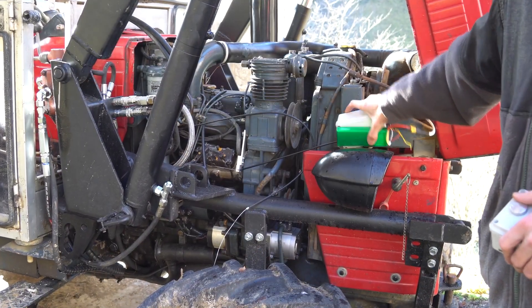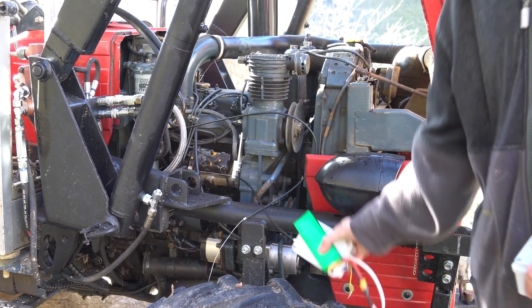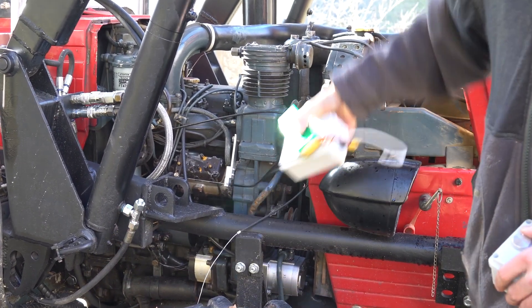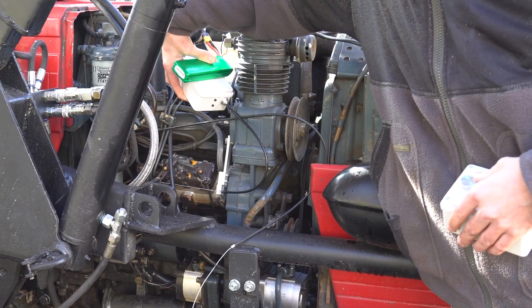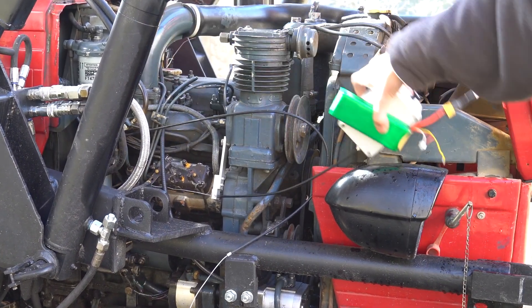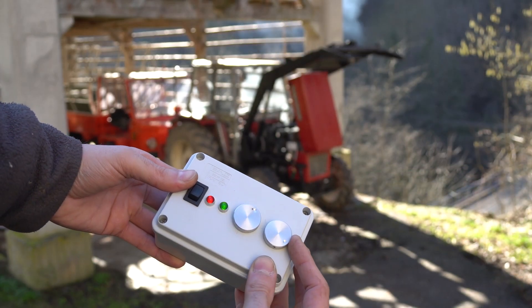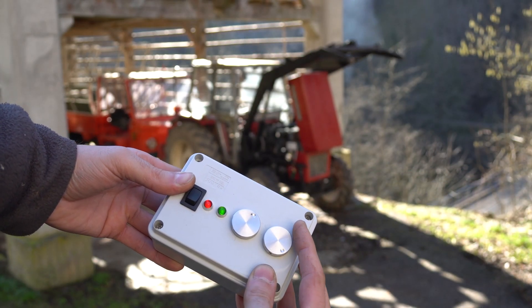Because of the steel wire inside a bowden cable, we can mount it wherever, in any position — even in a cab with a few meters of steel wire and bowden. For all the components I paid about 60 bucks, and there are still two free channels which can be used for a winch pull via relay, a cylinder, a horn, to shut down the engine, or whatever you want — another servo motor or a few relays can be connected.